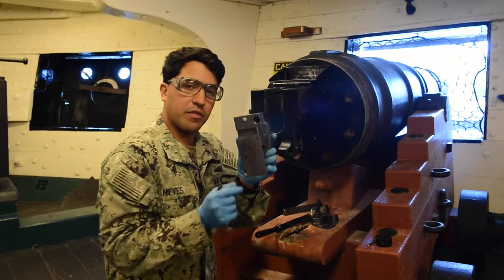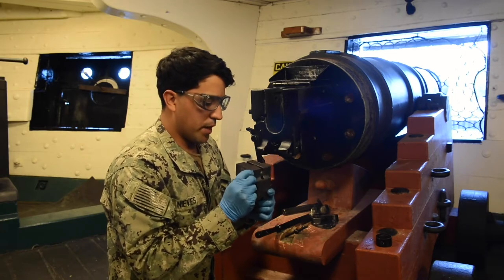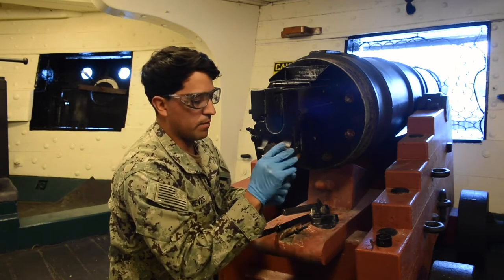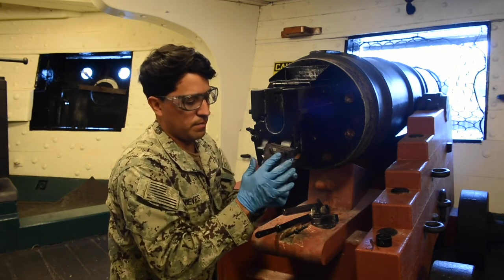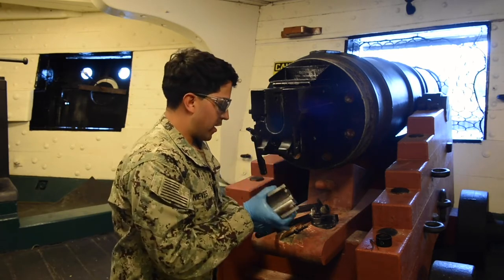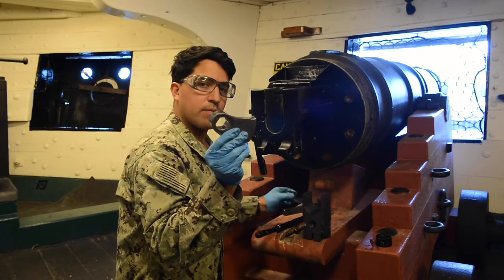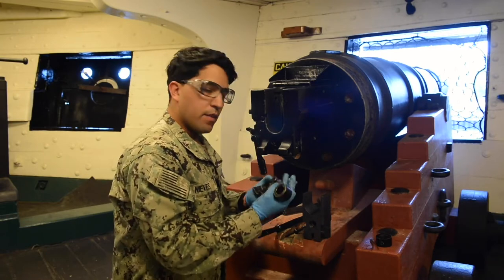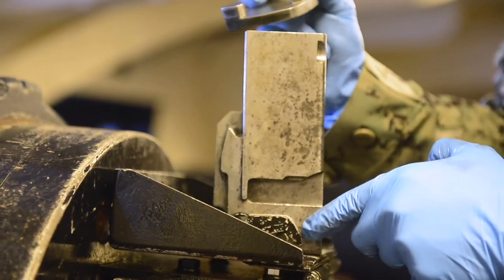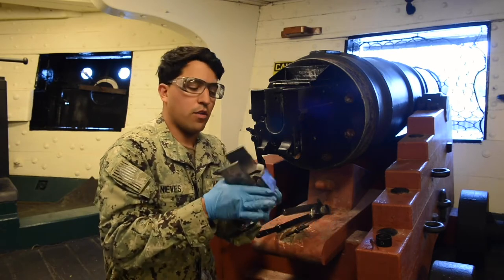It's not completely flush — that's okay. Use your cotter pin to pick up and adjust the inner cocking lever. Place the outer cocking lever so it's completely flush with the sear sticking out. Turn that back right-side up. You'll take your right hand crankshaft and left hand crankshaft — these are going to hold our breech block in place. Slide these on the sides. They do not click into anything, so you have to assist them fully the whole time.